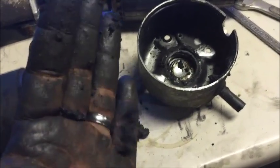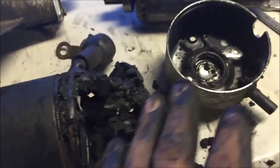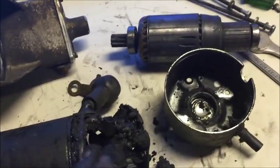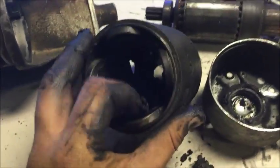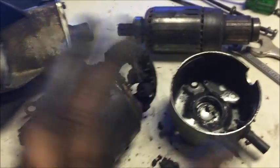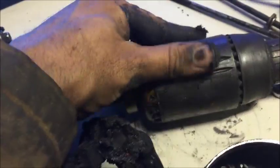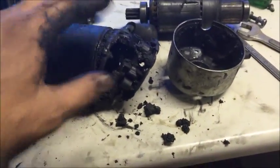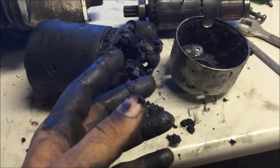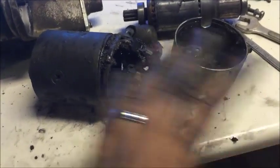Amazing that this thing was even still working. Hopefully it'll still work — I have faith that it will, but this all needs cleaned up. We should be seeing shiny colors of copper and silver right now, and we don't. Here's where we're going to use some brake cleaner — I love it because it dries quick — and we're going to clean this all up the best we can. If I had some chem dip I'd be dipping it in there, but I don't. Once we get this all cleaned up, if it still doesn't hold the armature, I know we're going to need another starter. Let's get a wire brush, maybe a little bit of gasoline to clean it — keep it away from fire, of course — and our brake clean, and lay it all down on a rag on the floor and do a good job cleaning.